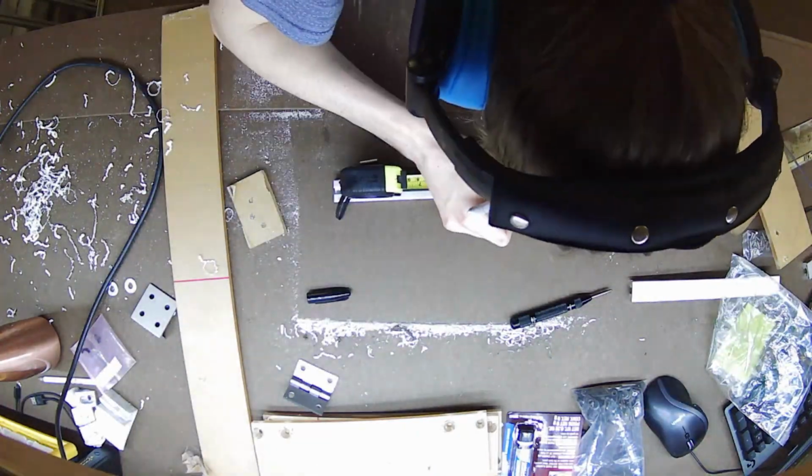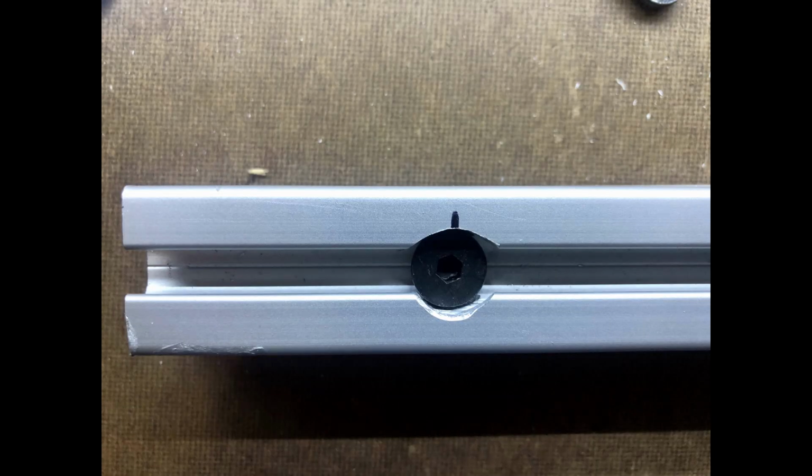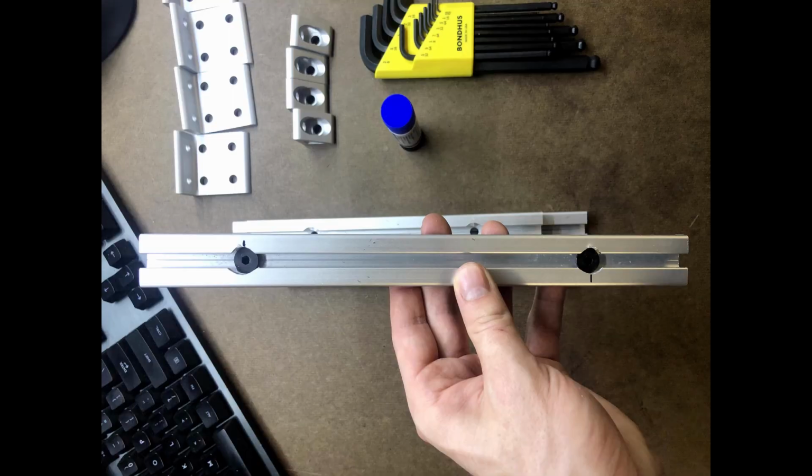Outside of the panel cutting, the other big machining aspect of this project was mounting the top plates. I basically drilled clearance holes for both the 1/4-20 and for the flathead screw, such that I could just clamp it down to the T-nuts.